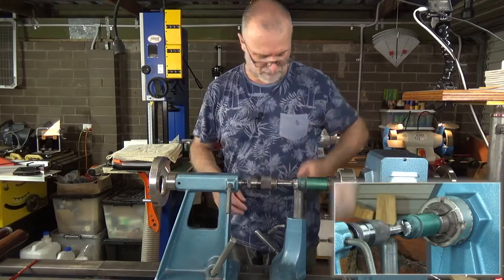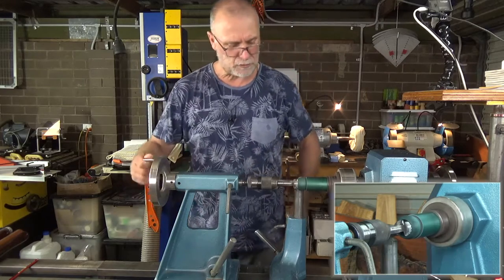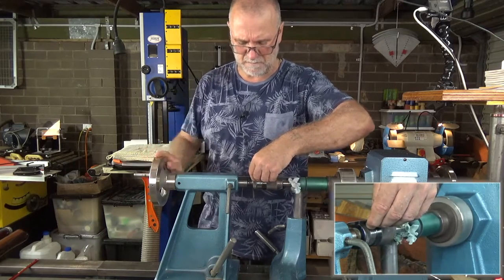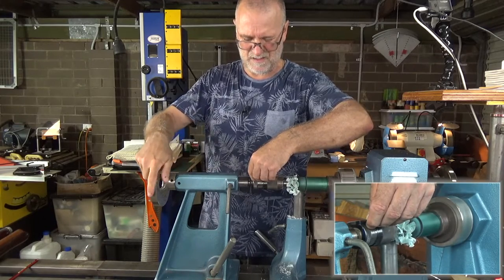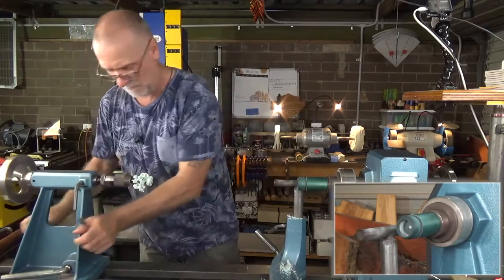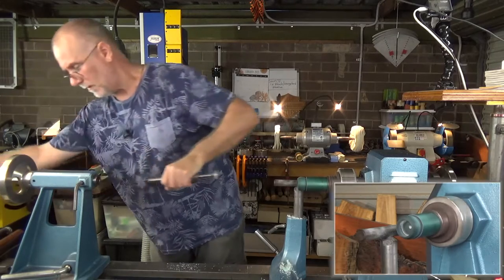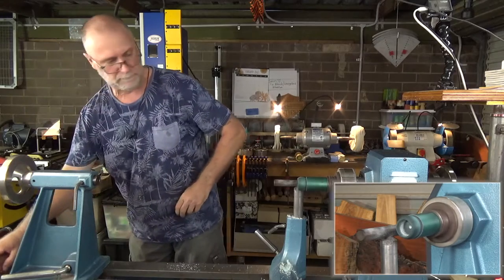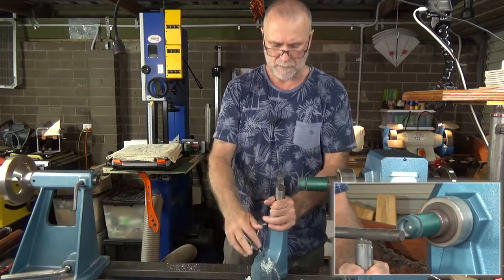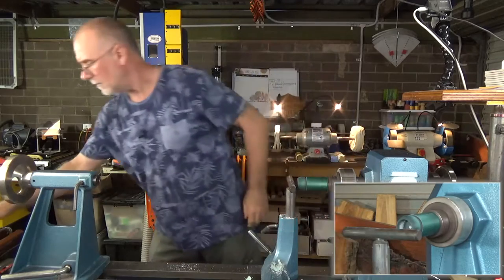So we've got 10 mil there. Start it up, speed it up a bit. Probably a bit there. You don't want it too fast for drilling. And that'll be the depth there. That out, tool rest, and a tailstock, and we will need to go back in again now and just open up the balance of that hole to 29. Probably drop it down a touch, speed it up.